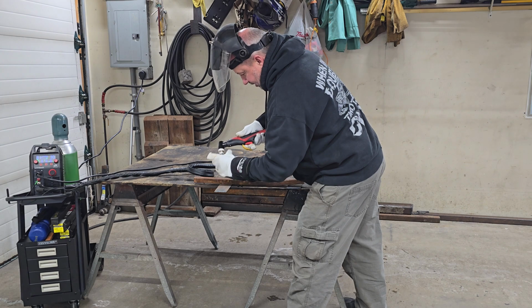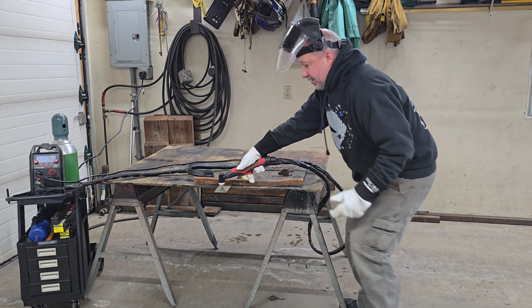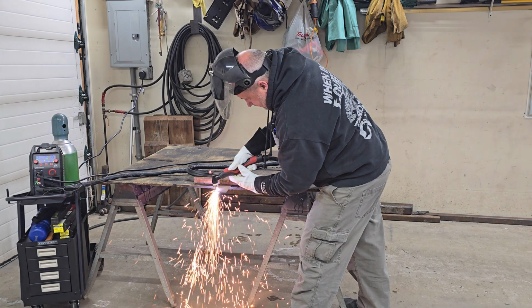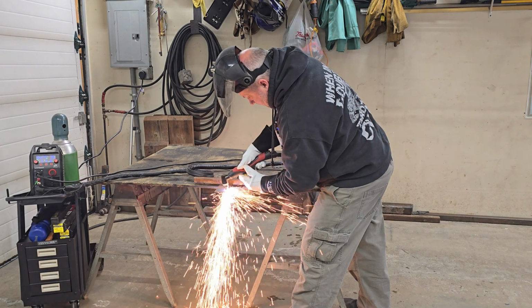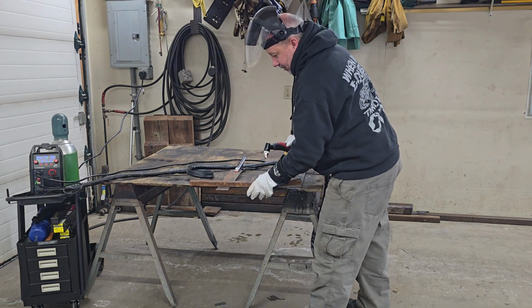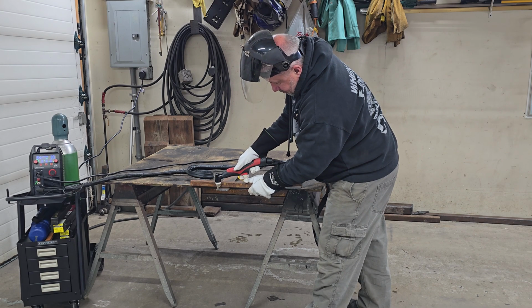I'm going to set my guide right there. Now, again, when you're sitting down on here, you've got about an 1/8 inch or so gap on that. So I'm going to go ahead, give it a little bit of lean in, pull as smooth and steady as I can, cut that part, right? If you want to get something that looks more like a machine type cut, you take your guide and you basically set your head against that guide.